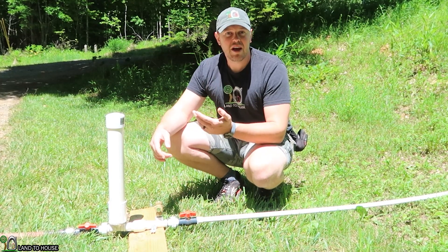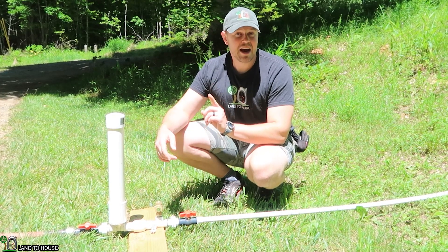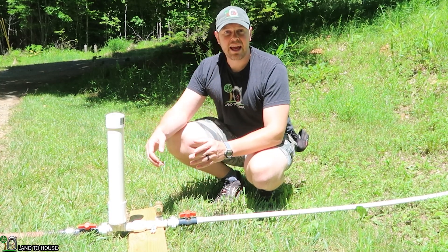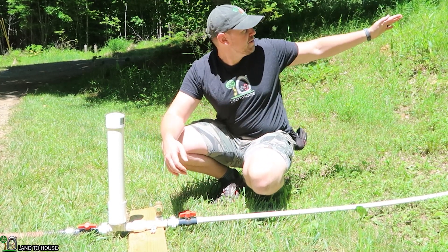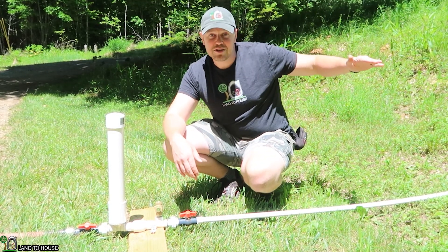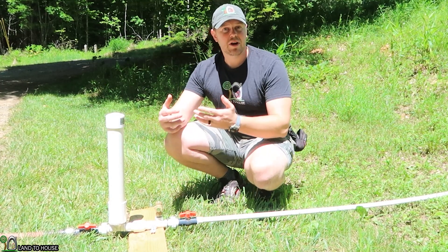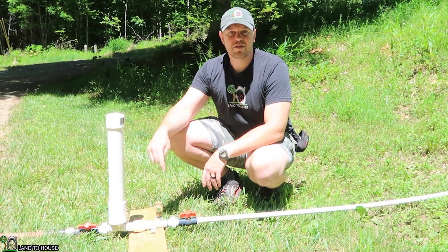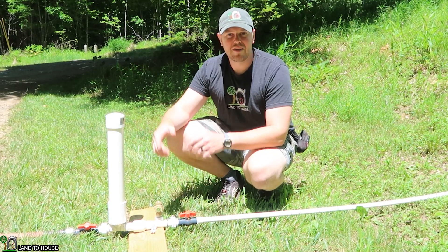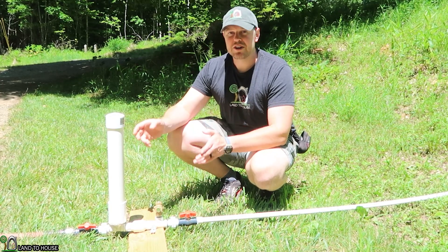A subscriber on YouTube channel Workbench Z suggested something that will save a lot of time: bring your delivery pipe down to the pump and let gravity feed from your source, fill that delivery pipe up to match the source, and then haul your pipe up the hill — it's already full of water. No sitting here for 10-15 minutes pushing this valve to get enough water in the pipe. Today let's demonstrate all of this and hopefully it will help you on your initial install.